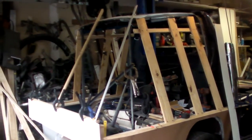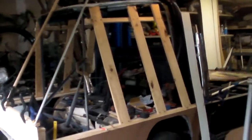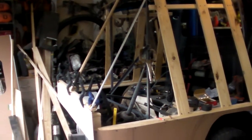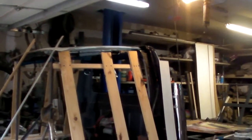But it will help keep everything flat. This will be removable. The framing will be removable from the inside. And I will have some screw holes to plug. Easy enough. Just put some silicone clay or clay in the holes, leaving a very slight dimple. So when I pop it out, I just sand the dimples down. Cool, yeah? Okay. I need to figure out how wide to make that rear corner.